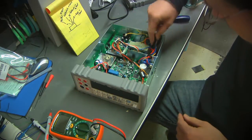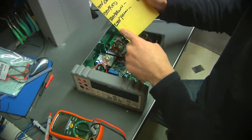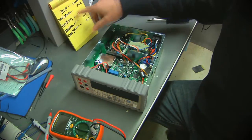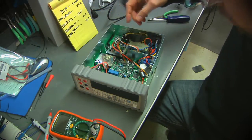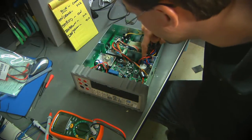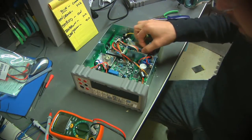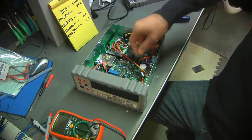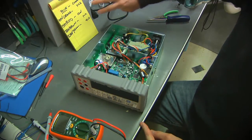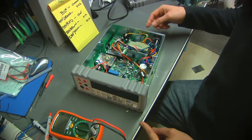And what I've done is I've threaded the yellow wire, which if you remember is the 240 volt. I'm now basically treating this yellow wire as the new common, being that it's the other side of the transformer. I've got that temporarily pressed onto the post up here where the blue wire used to be connected, so that when I flip the switch, it's basically going to put 120 volts across red and yellow instead of the old blue and red.